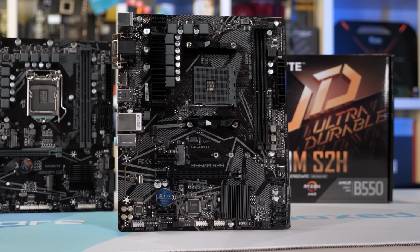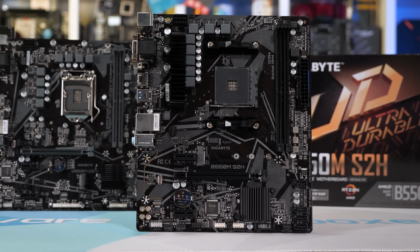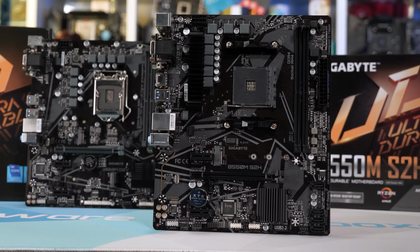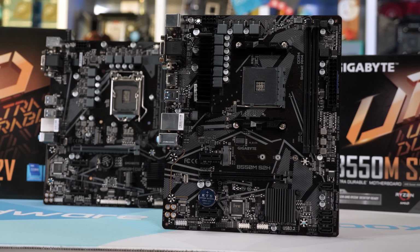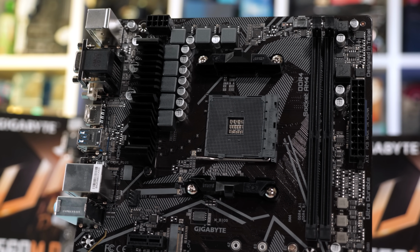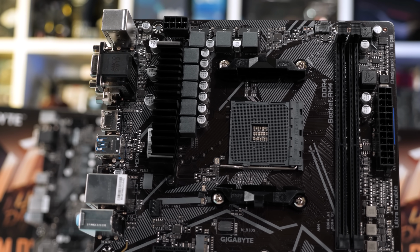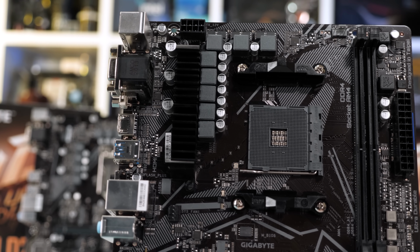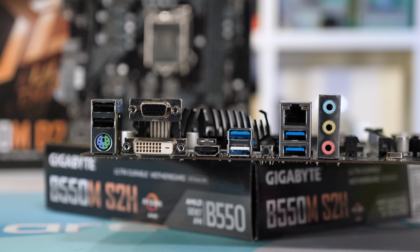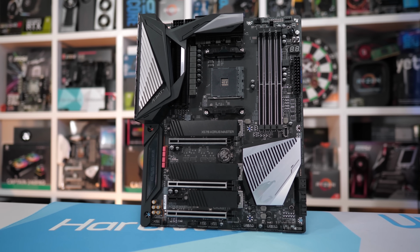All that said, Gigabyte makes an even cheaper and crappier B550 motherboard called the B550M S2H, and I picked it up for just $90 Australian, which should amount to around $60 US, so it is a dirt cheap B550 motherboard. It uses a very similar VRM to that of the B550M DS3H, though it is cut down, dropping one of the onsemi 4C06 low side FETs, so this is a very basic 5-phase V-core. So, if you bought this extremely cheap B550 motherboard, how well does it handle the Ryzen 7 5800X, and how much slower is it than the $370 Gigabyte X570 Aorus Master?